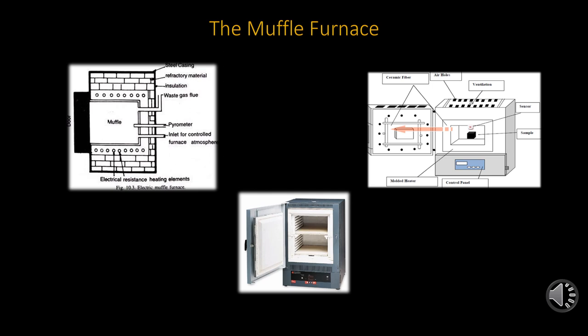Muffle furnaces at a glance resemble fusion furnaces; however, these furnaces are considered to be open systems. That is, they have a closed vessel chamber that is sealed from the combusting gases of the coke, oil, or gas fired systems. The vessel chamber also has an air inlet and an exhaust outlet separate from the exhaust chimney. This air inlet is controlled by some form of valve system. The new gas systems and electrical systems are electrically controlled, which allows for accurate temperature and airflow control. The coke and oil fired units are no longer used — gas is commonly used and so are the electrical units.